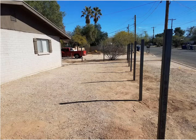And snap a good line and stick to it when you dig, and you definitely want to make a nice straight line. With a metal fence like this, especially the way we're doing it, where you're not going to see the posts from the outside, it's just going to be one long contiguous run of corrugated metal with a topper. If it's zigzagging, it's going to really advertise itself. So spend a little time to make sure you get a nice straight line.